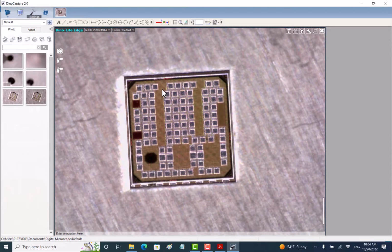Here you cannot, right? You see it's so small. So this is about 75 micron. This is 1 millimeter by 1 millimeter. Of course, I draw it very large. Although this is 65 nanometer, it can be much smaller. But you can imagine, for 40 nanometer technology, for 7 nanometer, or even 3 nanometer. Of course, they don't scale accordingly. 3 nanometer doesn't mean that the gate length is 3 nanometer, but it is super dense.